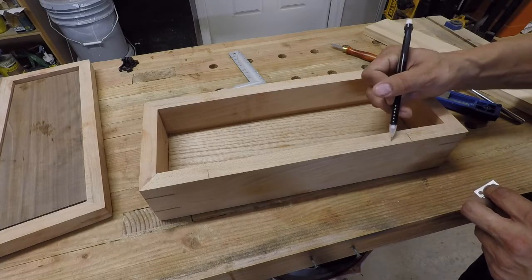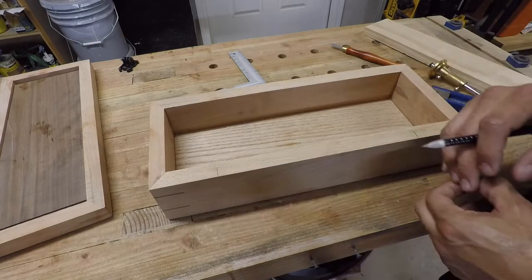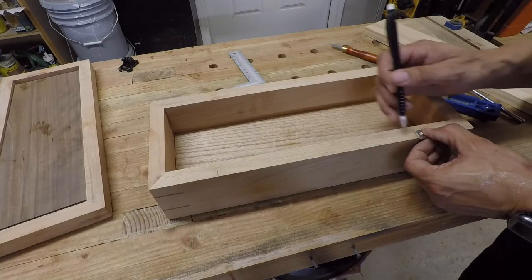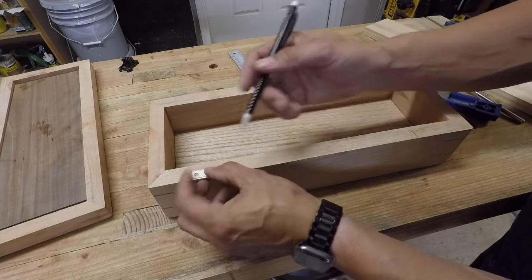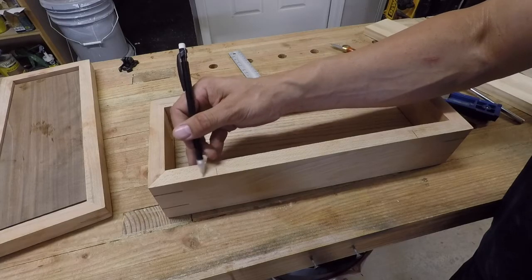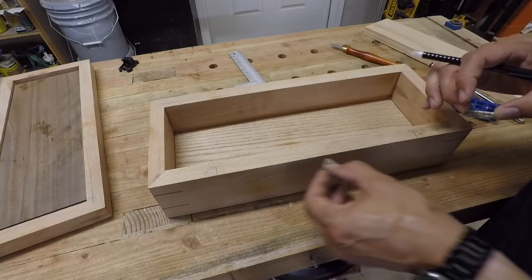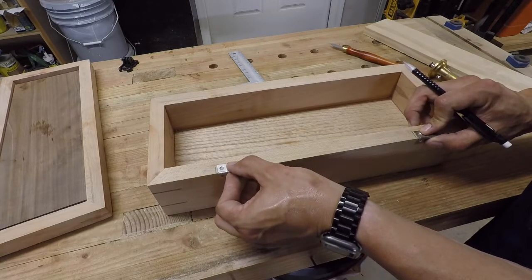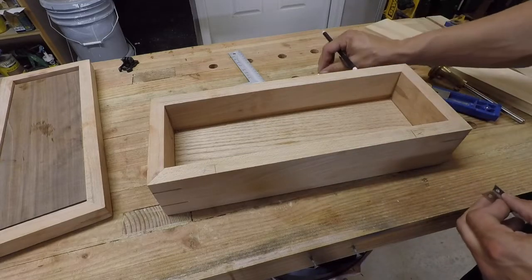The hinge is going to sit in this 90 degree corner and it's going to be in this direction. If I didn't make that mark, there's a chance I could actually cut the wrong portion out - you'll have hinges that are not correct. On the second one, the line is on the inner portion of the hinge facing the other way. Make sure that you mark the direction of your hinge. You can even put an X there so you do not confuse yourself as to which way the hinge lines up.